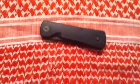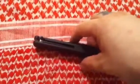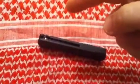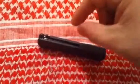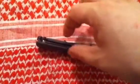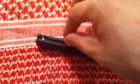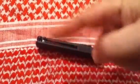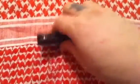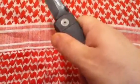Because once you take a piece of steel, especially a spring, the more coils it has, the more chances it has to fail. But if you take sprung steel, which is what this is, it's the same type of steel that you make a spring out of, but it's not been coiled. There's no real true weak spots in it. It's a beautiful, beautiful thing.